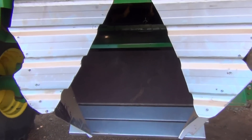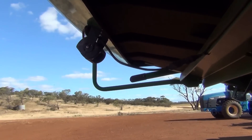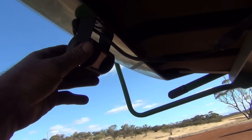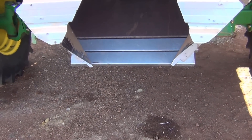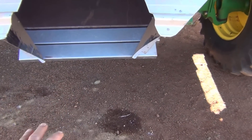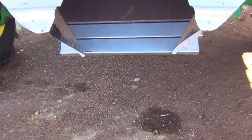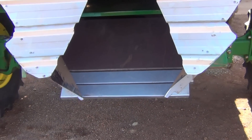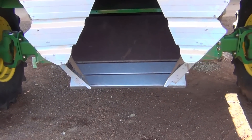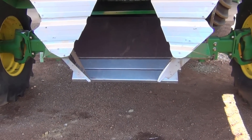I also mount a CCTV camera on it — you can see it there — and that will be looking down just in this area. Because when you stop the harvester, you don't want material to accumulate on the ground and build up and choke the harvester as you get going. It's well worth the money spent just to be able to visualise that when you restart the harvester and make sure it's not plugged.